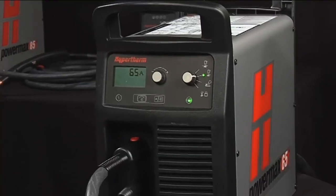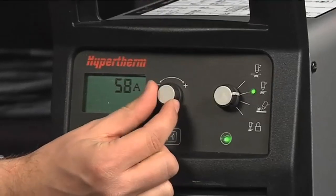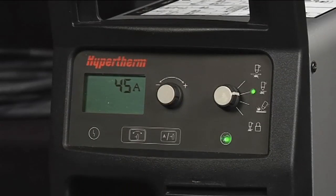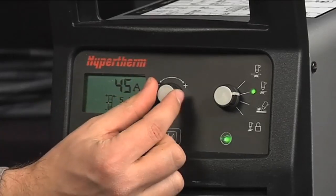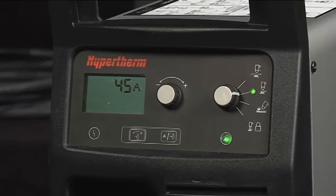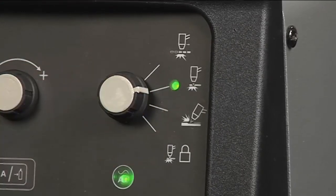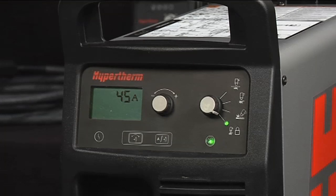While there are some slight differences between PowerMax models, they're all pretty easy to set up for hand cutting. The PowerMax 65 has a very intuitive control panel with two knobs, two toggle buttons, and an LCD screen. This knob has two functions: if I want to lower the amperage — say for cutting thin metal — I turn the knob down. If I want to override the smart sense function and manually adjust the gas pressure, I push the gas button, then turn the same knob. The other knob is used for selecting the operating mode: continuous pilot arc for cutting expanded metal, standard cutting, gouging, and the new trigger lock mode for making long cuts without hand fatigue.